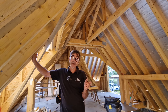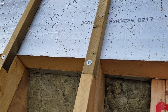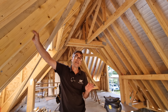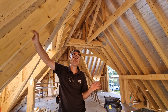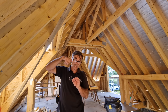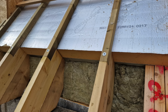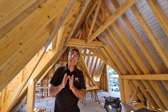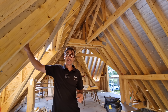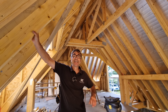You do have to use very long fixings. You might think that fixing is going to cold bridge all the way through — but the fixings are 220mm long, we've got a 175mm rafter, and the chances of bridging coming all the way down through those single fixings is fairly slim. You can't really avoid it. If you were just putting insulation over the top of the structure and bonding something to that, you could use small plastic flanges with the fixing lower down — but you can't really do that with a large 45 by 45 counter batten. Any questions, please don't hesitate to ask. I'll be doing a follow-up video when we insulate the inside of the roof using Gapotape as well — until then, stay tuned.